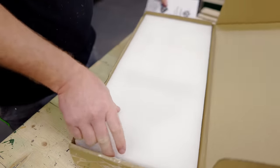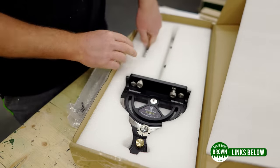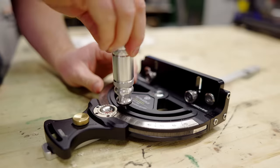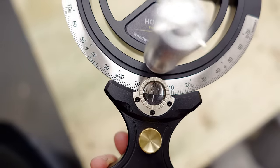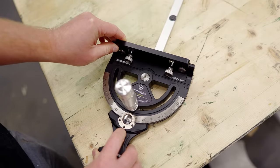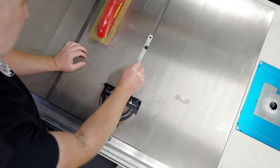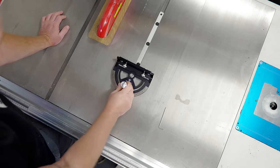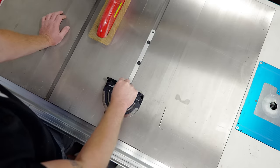So I've spent some money on one of these — this is the Hongdui miter gauge — and I must be one of the few YouTube woodworkers who hasn't managed to get one for free. I've seen a lot of reviews and it's spoken about very highly. I'll leave links to my favorite reviews and where you can buy it in the description. It's a beautiful thing and it exudes quality. It has incremental teeth at one degree spacings and stops for commonly used angles. You can tighten the machine screws on the bar to achieve a perfect fit in the miter slots with no side-to-side movement, which really puts the miter gauges that come supplied with machines to shame — especially when it's such an easy problem to solve using plastic washers that simply expand when the machine screw gets tightened.